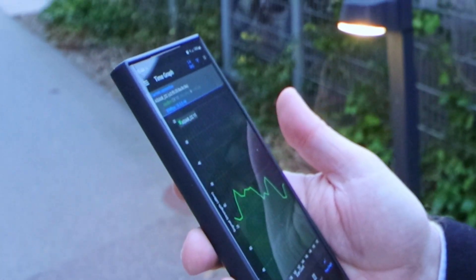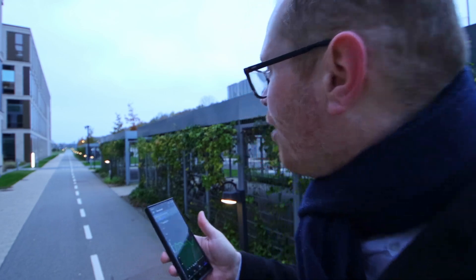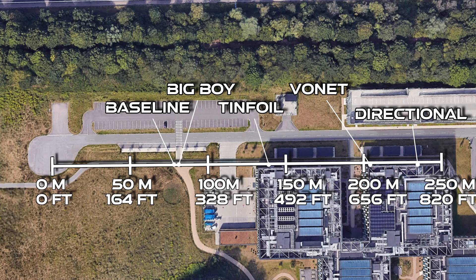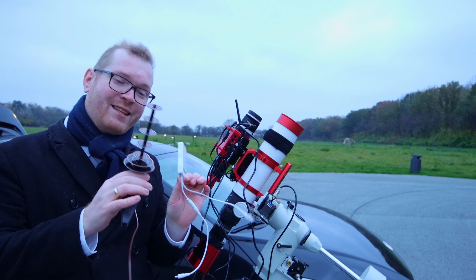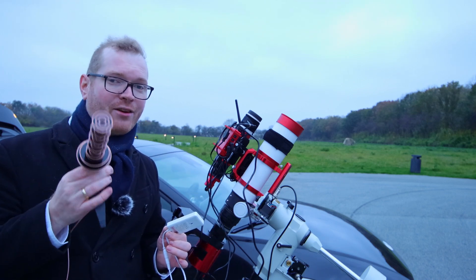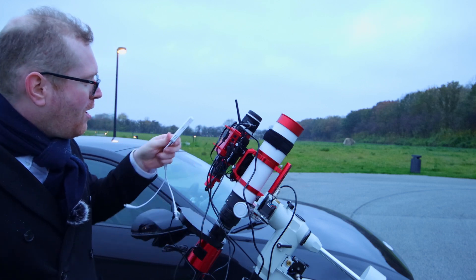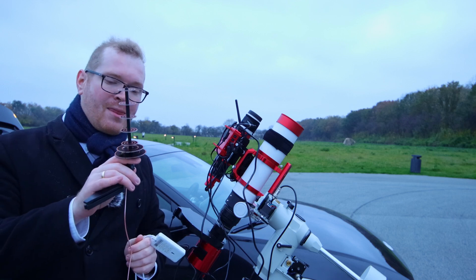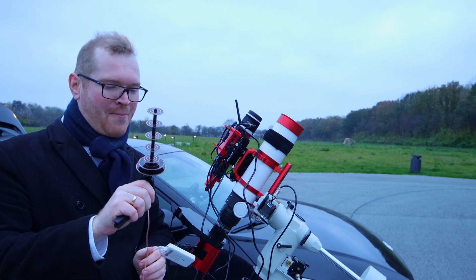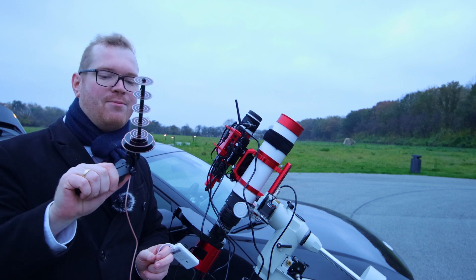Yeah, I think we're done here — it drops down again. I think this is about as far as we've got. We got slightly further than we did with that little Wi-Fi repeater. But just look — the car, I don't know if you can even see it anymore, it's down at the end of that. For Wi-Fi, that's kind of impressive. These two here almost got the same range. The main difference of course is this antenna here is highly directional, while this box is omnidirectional — it sends signal out in all directions. I think the WONET box is my personal favorite, as it's small, it fits on the telescope easily, I built a double-sided tape mount and you can basically stick it on top of your ASI AIR — it powers everything off the ASI AIR. It's a nice product and it works really well. While this directional antenna gave me the best results, it's also a little janky — you need to know exactly the direction you want your Wi-Fi to be beamed. But if you do that, I actually think this might be a workable solution as well.